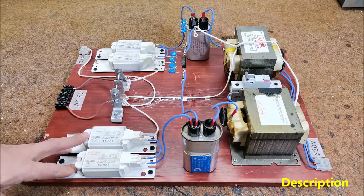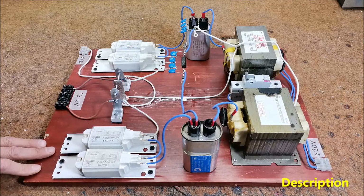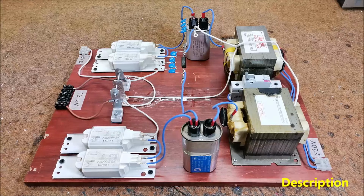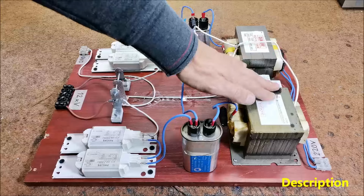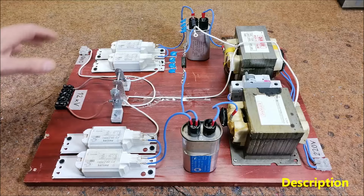Alternatives to the neon sign transformers are microwave oven transformers, because they are universally available for free or at very low cost from broken microwave ovens. But the voltage of their secondary is not sufficient to drive the spark gap Tesla coil. The simplest way to achieve it is to use more than one microwave oven transformer. Another option is to use some sort of voltage multiplying circuit. It is most practical to use both options, two transformers plus a multiplier, which is described in this project.